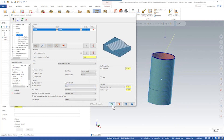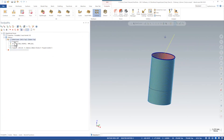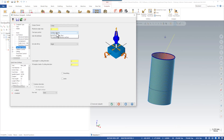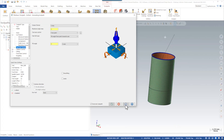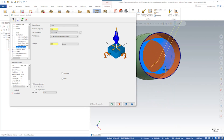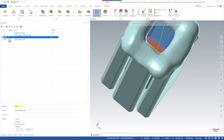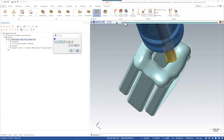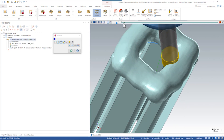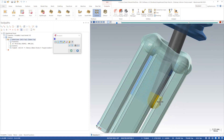Now with the spiral there are going to be no reversals, but our tool orientation is no good here, so we have to add a little bit of information. In this case we are using a from point — from this point here. So now the tool will always come from this point while it's machining down here. This is now a toolpath that looks a little bit more useful, but if we turn on the level that isolates the chimney we can see we're still going to have some problems: we're gouging the snow up top, and as we get down lower we're still having some collisions between the tool and the actual chimney body itself.